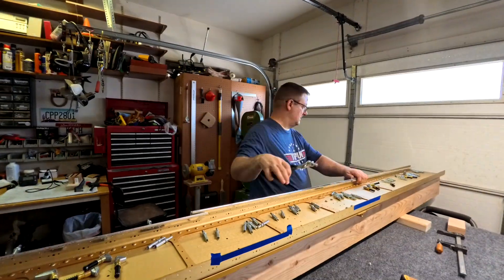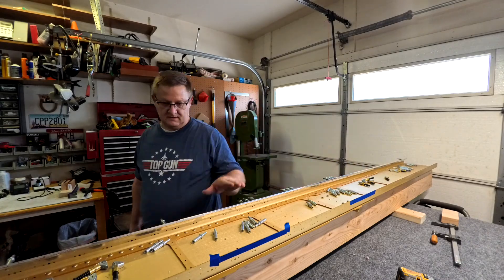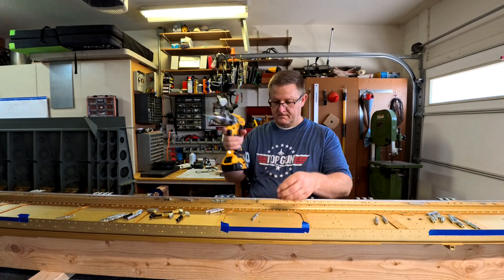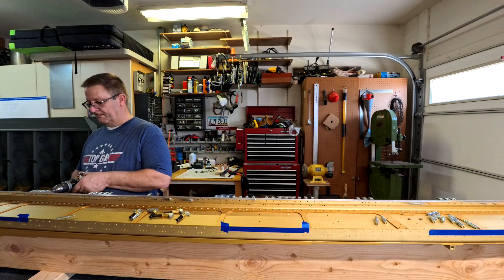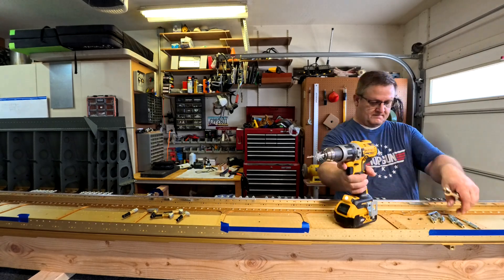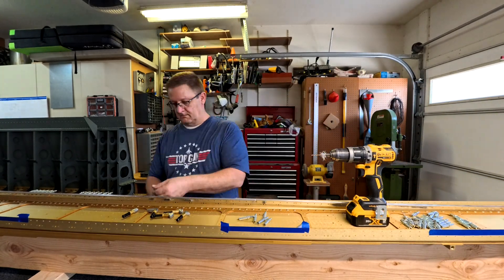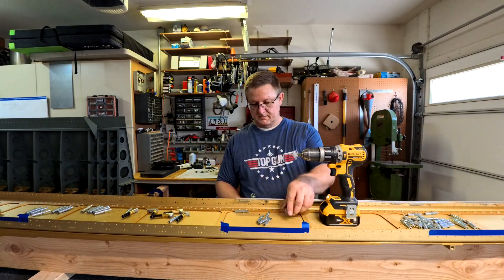When you're looking at it, at first it is confusing, but it makes total sense because the J-channels actually fit in a portion of the skins that are not where the access panels are, so you want the consistency of the holes to be in the right order. When you get three or four more steps into the process you're like, 'Oh, that makes perfect sense.' Follow the instructions — sometimes they won't make sense, but they are correct. When you think you're smarter than the instructions, you're probably going to mess up.